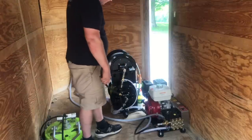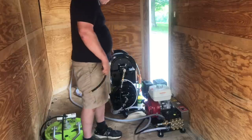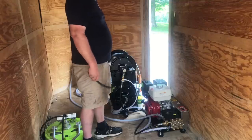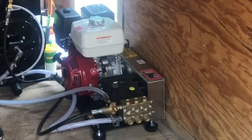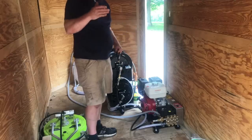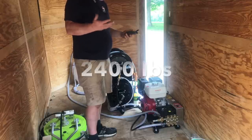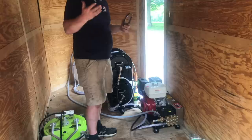This is the whole reason I run a buffer tank — to help supply the pump in case the customer has bad water, just a little bit. It doesn't take long to get 35 or 30 gallons full, since about five gallons is where the filter sits. I just need this buffer tank to keep the pump from overheating. We can absolutely use big tanks — I've got a big tank on one of our trucks — but 300 gallons of water is a lot of weight. Times that by eight, that's almost a ton and a half of water.